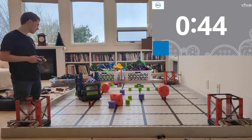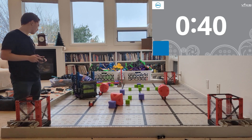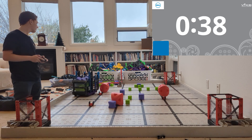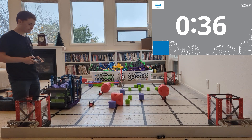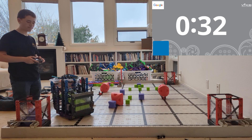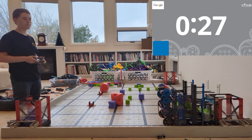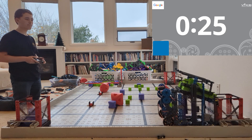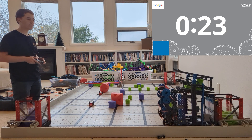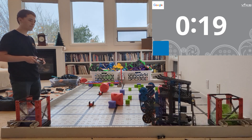What's really cool about this robot is it actually has the ability to pick up both green and purple cubes. If you watch it as it drives around the field, it picks up both green and purple. As the driver, we do nothing, and inside the robot it is actually sorting them between green and purple. It sorts them based on size, so there's no color sensors, no intelligence behind this or anything. There is literally just a slot inside the robot that fits a green cube and does not fit a purple cube.